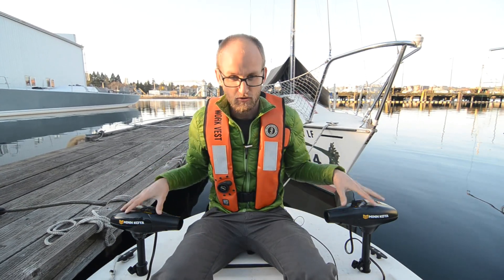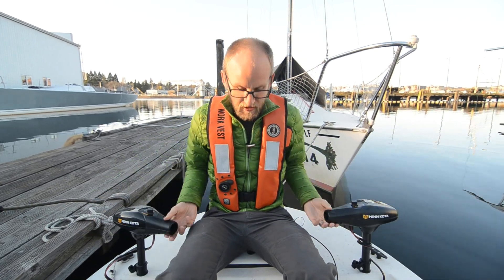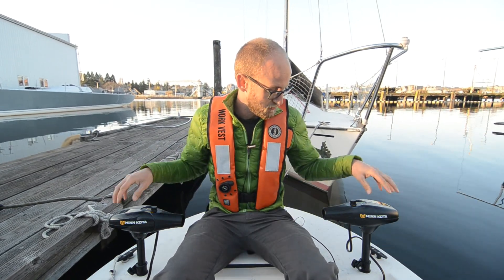I've got two drives that can rotate 360 degrees. They're electric trolling motors, and I've pulled out the normal control throttles on them and replaced them with pulse-width modulators. Basically, they're chopper drives that allow you to maintain your full voltage when the drive is on during a square wave waveform. When you want less power, you just chop out the amount of time that it's at 12 volts to lower that power, as opposed to actually lowering the voltage or limiting current through some resistive process.